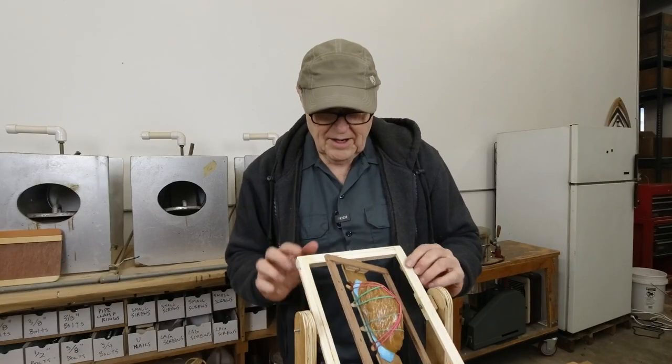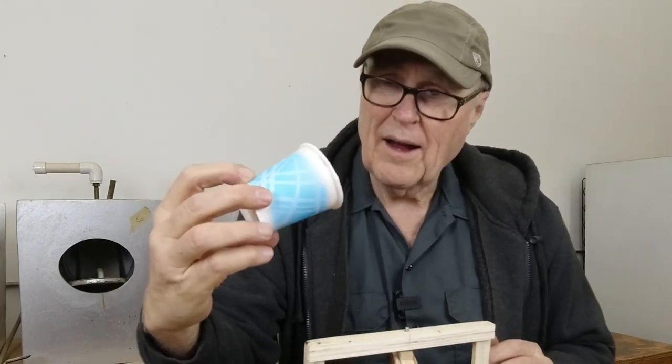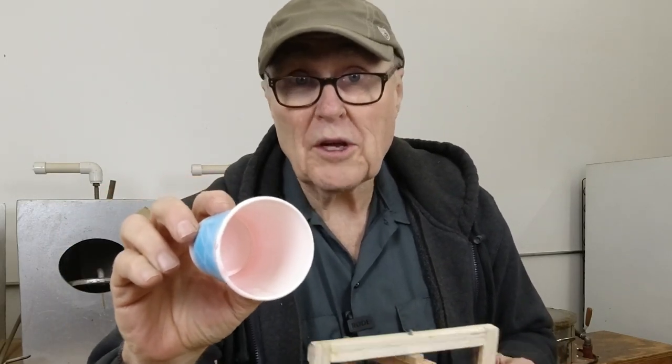Try to be as random as you can be. You just get a rhythm going and you keep an eye on your witness cup, which is right here, because the witness cup is going to tell us the status of the resin. I'm noticing as I look in the witness cup that it's barely sagging at all, which means it's pretty well cured.